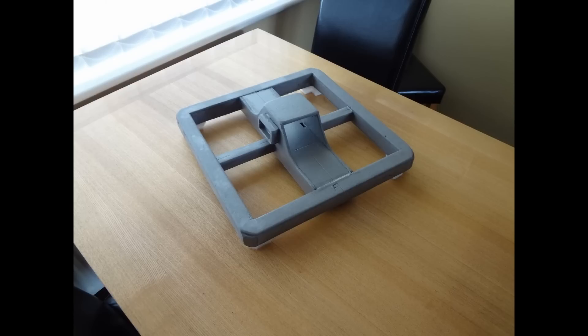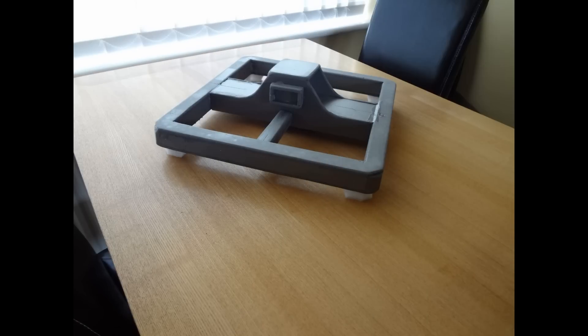These next two pictures show the upper frame with the central control area installed. It is large enough to accommodate a single or double battery as well as my KK-2 flight control unit, which will sit on the top. On the side, I added a small housing for my 6 channel receiver. I then dropped in the two side bracing pieces, made in the same way as the frame for added strength. The central control section was also made box sectional, again with internal ribs to help stabilize and strengthen that area.